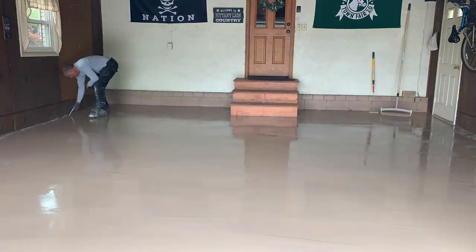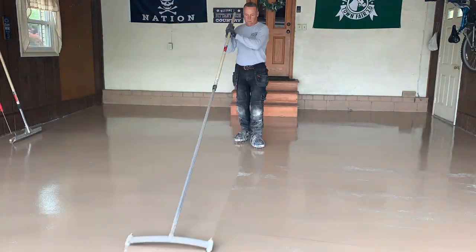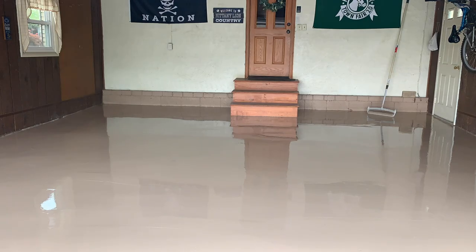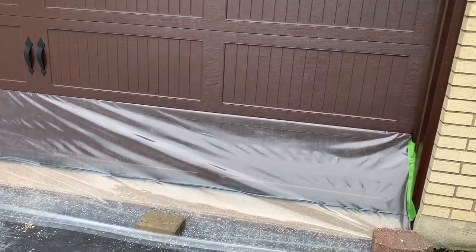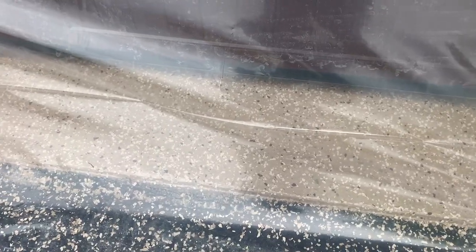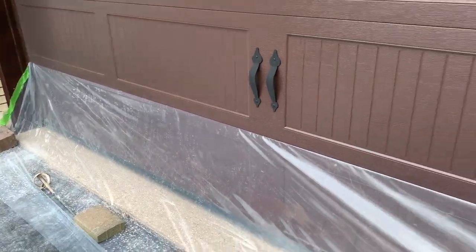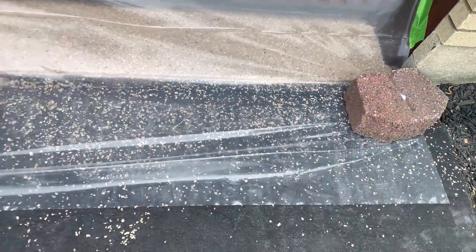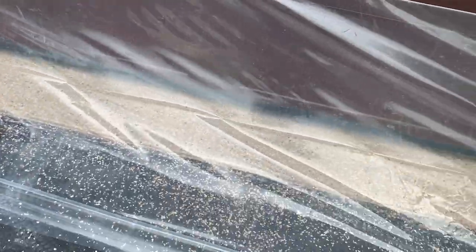We are applying the CFS 707 LVP in the SE Camel color. We got that applied — Jeff's back rolling. Now because of the rain, we have to do the second coat right away. This is the intermediate coat. Jeff is going to back roll that intermediate coat and I'm going to flake it, and then we're done for the day. You can see the flake through the plastic — it's tucked into that first joint all the way across. I put a little tape on the edges just in case it rains, and we put blocks on the plastic. So now if it rains, at least I won't have a heart attack. We'll be back tomorrow to do the 137 MUV clear coat.